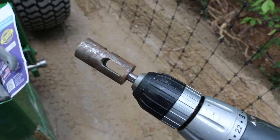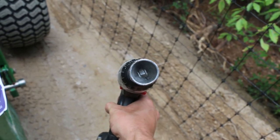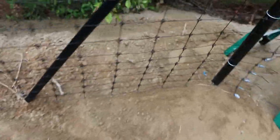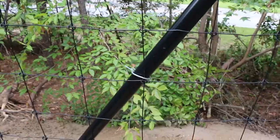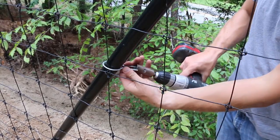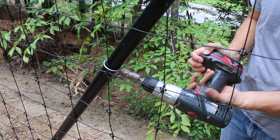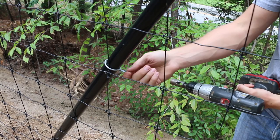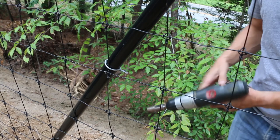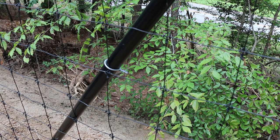And then you've got an adapter that goes on your drill. And if you look down there, it'll focus. You see it's kind of slotted. So basically what'll happen, let me put this on the tripod. So we've got our cable hooked around. We take this, and then we've got our clamp hooked around. Put it in your drill. And then as it spins, it tightens it down and then it clips the end. So that's a really quick way to put on a bunch of these clamps and put this fence up